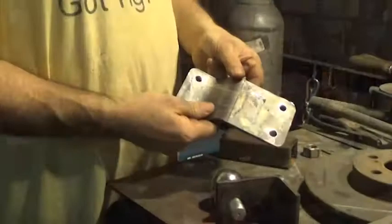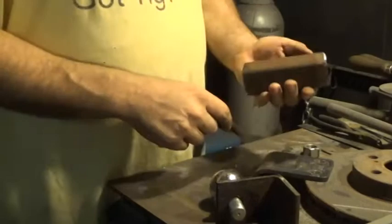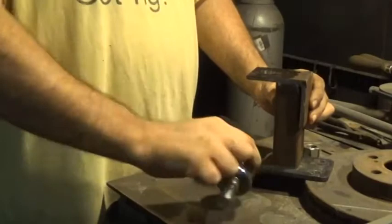All right, YouTube, I got my holes drilled and I made the bottom plate off camera. The way this is gonna work, I'm gonna have the plate sitting on the tractor housing itself on that bar. This is a 5-inch piece of, I believe it's 1 inch by 2 inch, and this will sit here. I have beveled the back of this so the angle iron will sit flush, and I'm gonna weld the seam here and around the base. And all I'm gonna do is drop a trailer hitch ball in.